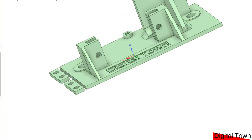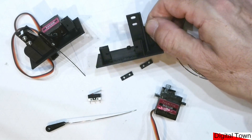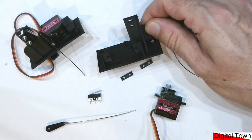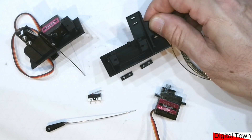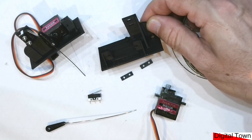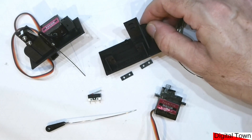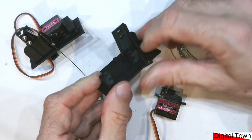Here is the print. This one I've printed out of Creality Hyper PLA. I've had these on my layout for just over a year with various prototypes, and I've always tended to use PLA Plus. You'll get away with PETG. You could go to ABS or something fancy. I wouldn't tend to use just standard PLA — it might go a little bit brittle over time. PLA Plus is better and has a little bit more flexibility.